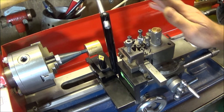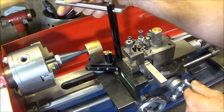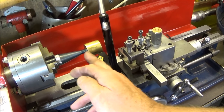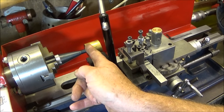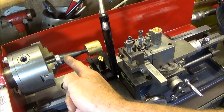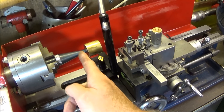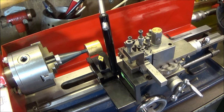Before I start machining the ball I make sure that the cross slide is wound back far enough so that I don't come in first with a heavy cut. You obviously need to take quite light cuts because the work piece is quite far from the chuck. I could afford to turn this one back a little bit more to allow it to go further into the chuck, which I probably will do at a later date, but my machine will handle it because I've got some tapered roller bearings in the headstock.